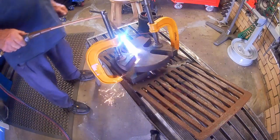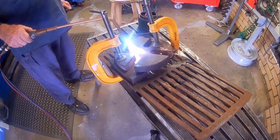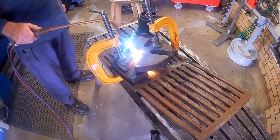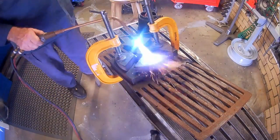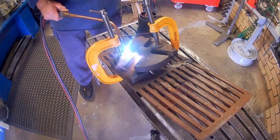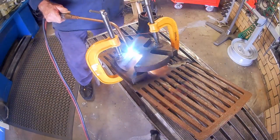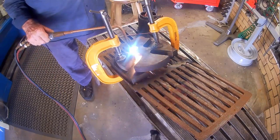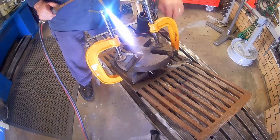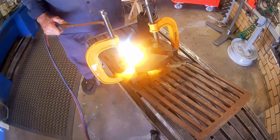Once again, the carbon-rich particles of cast iron from the grinding provide an occasional display of sparkles. Preheating done and armed again with the flux-coated nickel bronze rod, I proceeded to braze the other side of the joint.